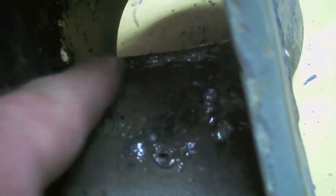While it was apart, I took the opportunity to clean it up a little bit. This was a raised lip that they hadn't bothered to weld, so I hammered that down flat and bridged that gap. It's still a little rougher than I'd like, but it's really hard to get in there. And then this was an open joint, so I went ahead and welded that up as well, so that it didn't have as much to go over. Then I took the sidewinder with the sanding pad and smoothed this out some.